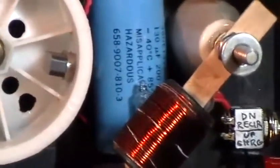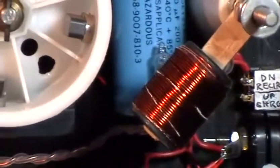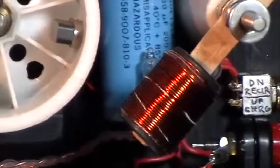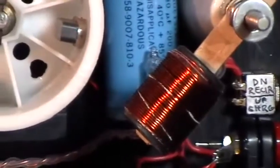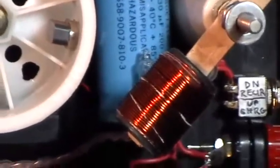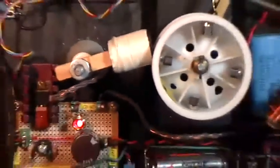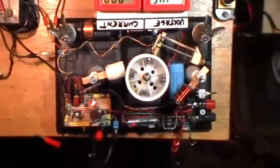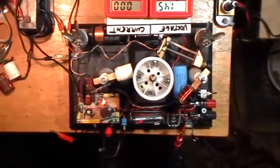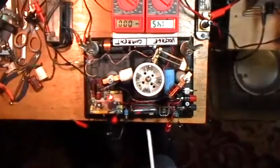That's the same long tall Texan toroid core with the same amount of wire — I just wound it around the outside just like a solenoid, and it's stuffed onto the toroid, slid onto the same popsicle stick mount I normally use. The other side is the same, just wrapped with tape. So these are solenoidally wound coils.